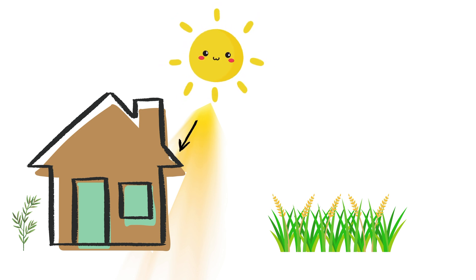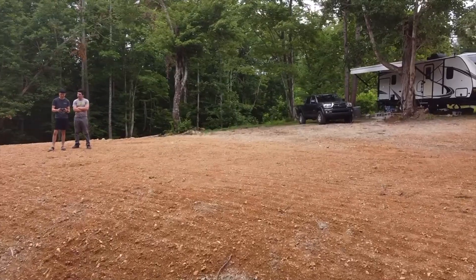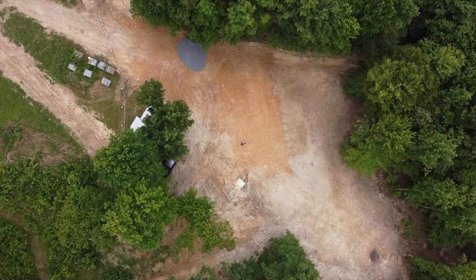With the right measurements, the windows will get no direct sun from about March 20th through September 20th, our hottest months. And because the concrete slab is buried in the earth, it will stay close to the cooler ground temperature, helping the house stay comfortable even in the heat.